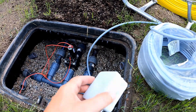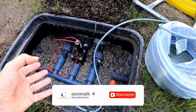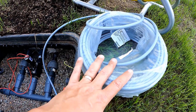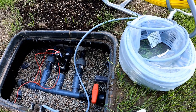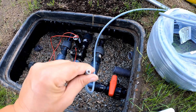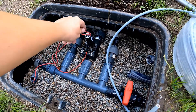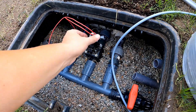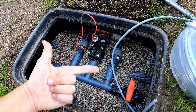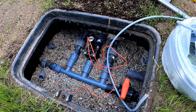Once I finish and have connected the other cables as well, I will install a larger distribution box and fill it with an epoxy resin to provide permanent protection against water. On the other end, this cable is pulled through and connected to my Hunter X-Core irrigation computer. It is important to know the right number of wires and to order the correct cable. You need one wire per valve, a ground cable, and a cable for the voltage. For two valves you only need one ground cable but essentially two cables for the voltage. The formula is: number of valves plus one.